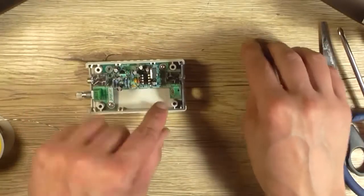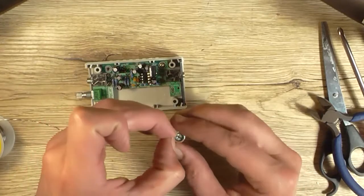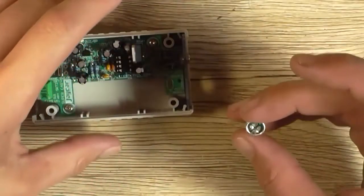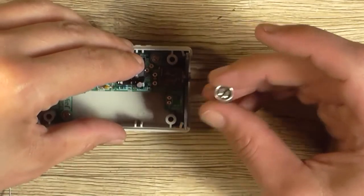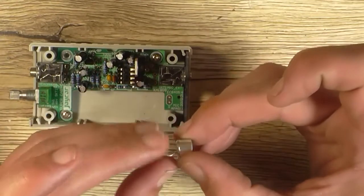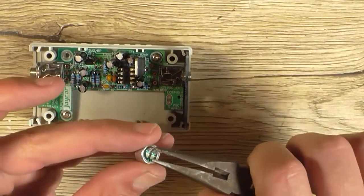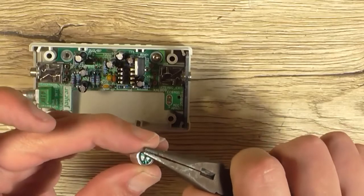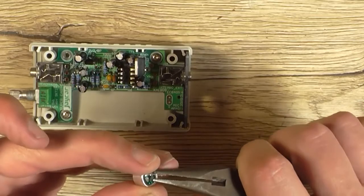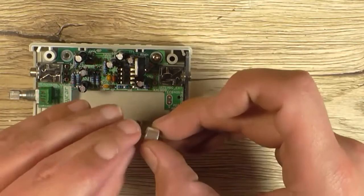Alright, so microphone mounts there. So I want to get this the right way around the first time, so I've got to figure out where the positive is. It's not clearly marked. Even though it's not marked, I just read the instructions. You fit this to the PCB with the leads closest to the PCB so it matches the polarity. So that's exactly what I'm going to do. And if it doesn't work, well, we'll soon know why. But yeah, it would have been nice if this had the polarity marked on it. It wouldn't have been that much of a difficulty to do.